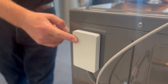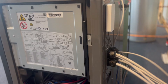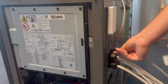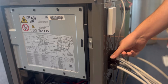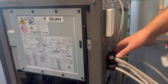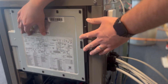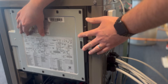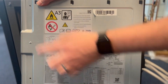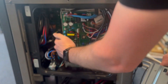We've got it stuck on the back of the unit, but this would normally be located inside the property. With this being an R290 unit, cable glands are already installed — it's important these are used and the installer doesn't drill their own holes. As this is an R290 unit, the electronics are contained within an explosion-proof container, accessed by unclipping. This would also normally have a couple of screws securing it, and the cables can then be threaded through the unit.